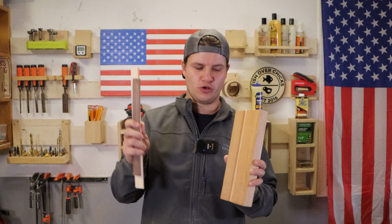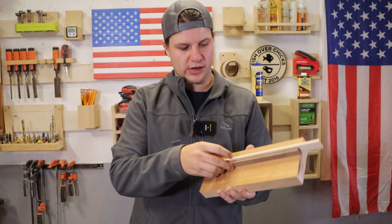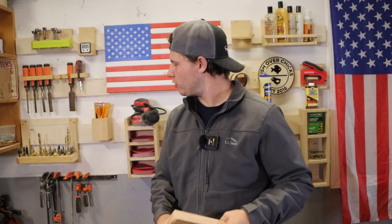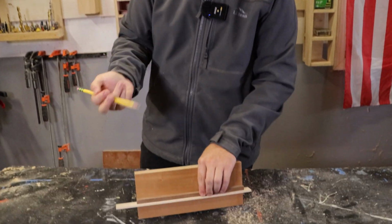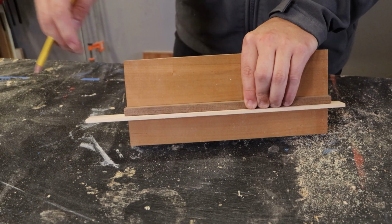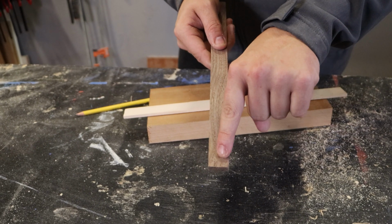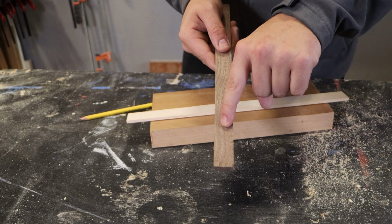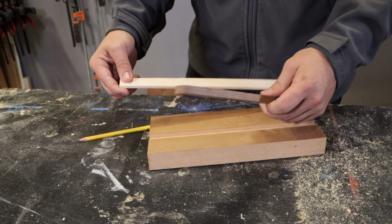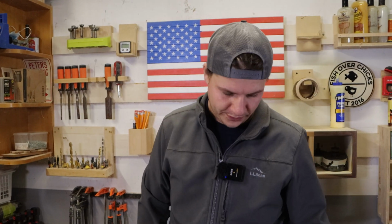So once you've got those 2 pieces slotted perfectly in there, now we need to cut these pieces down. How we're gonna do that is we're just gonna take a pencil and draw a mark. Once this is pushed into that groove, we're just gonna draw a mark right there on one of them. And then once you've got one mark there, we're just gonna cut a little bit fatter than there, cutting this down on the table saw, and then we'll get this down, placed, glued, sanded.